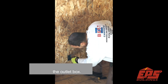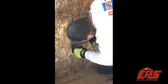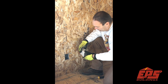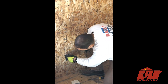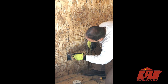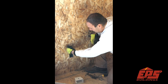So there's still a little bit left over in there. You can clean it out a little bit. And then we just use the standard box. Cut the ears off with the nails. Make sure she fits in there. It sticks out your half inch for your drywall. Right here you can see the channel is right here for my horizontal. And then right up here just two inches up, which is an easy jig up. You can pop up and go horizontal.